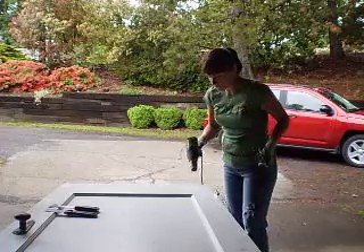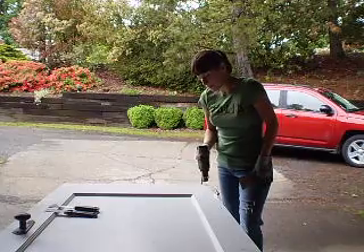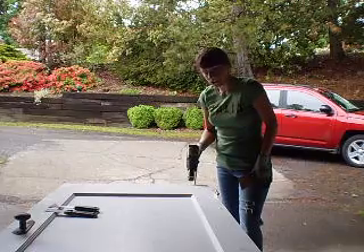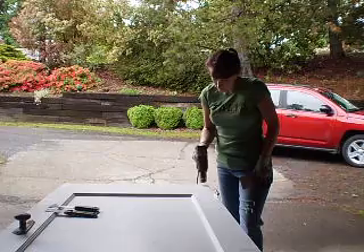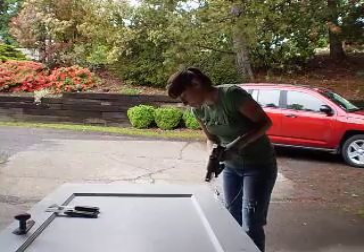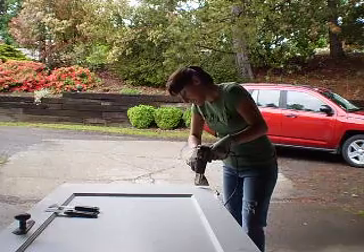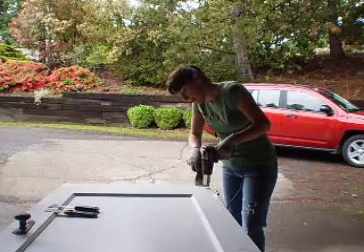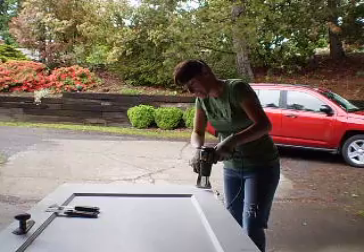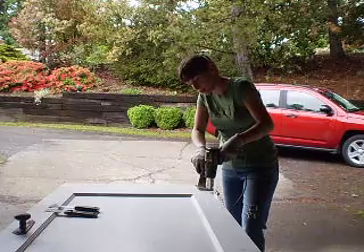What I'm going to do is heat the paint down here at the bottom until it starts to bubble. It just really takes only a few seconds to get bubbly. Then once I start to get bubbles forming, I begin the scraping process. I keep the heat gun just maybe an inch and a half ahead of the scraper, and I'm able to just move along pretty consistently — slow but consistently. And this is taking it straight down to the bare wood. This is beautiful.